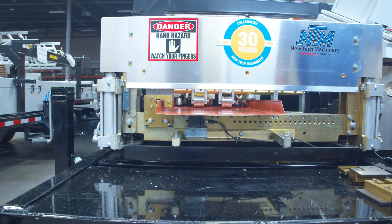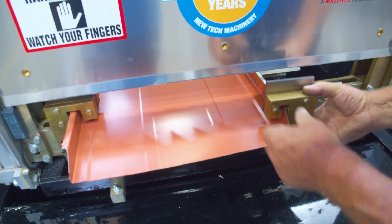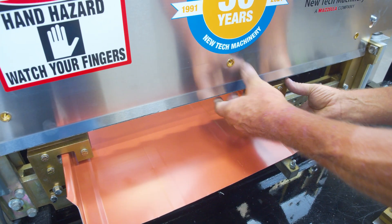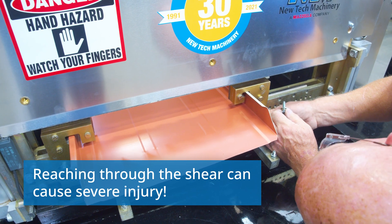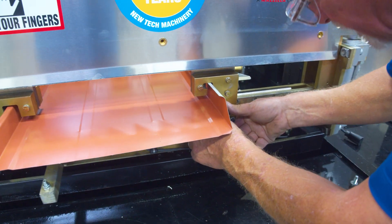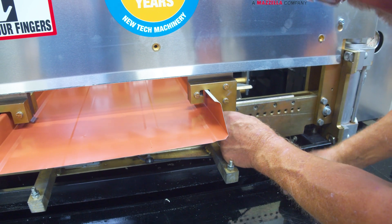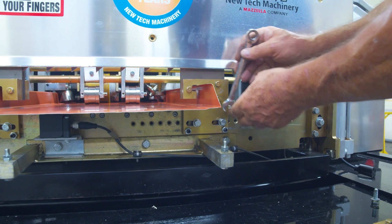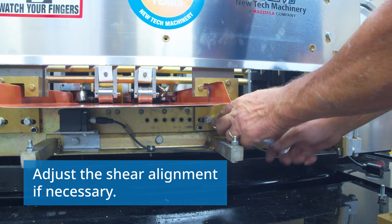I'm going to go ahead and bring it out a little bit, then shut the machine back off. I'm going to put the exit die on, get it set up, lined up pretty good, and then get our bolts in. Again, you don't want to be sticking your fingers through the machine. On the entry side die you want to go over the top and in — never through the blade area. We're going to get the bolts in, look at the alignment. On this one the blade comes down and shears that way, so we want to make sure the backside is supported so it doesn't get damaged. After we get that set, we'll tighten it up, start it up, shear it, back it up a little bit, and then put the other die on.